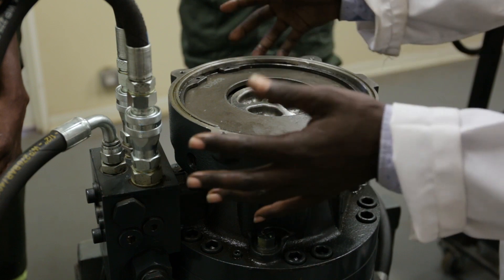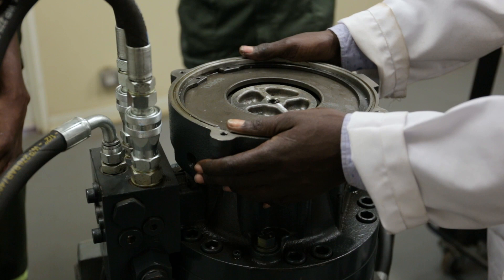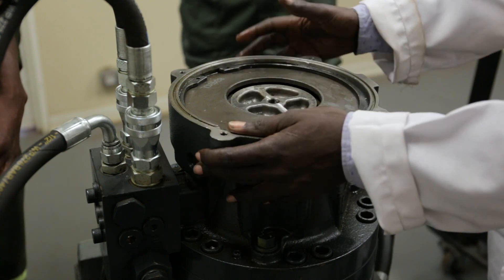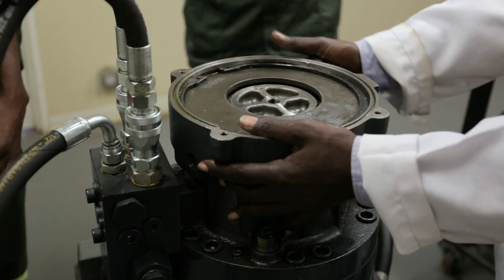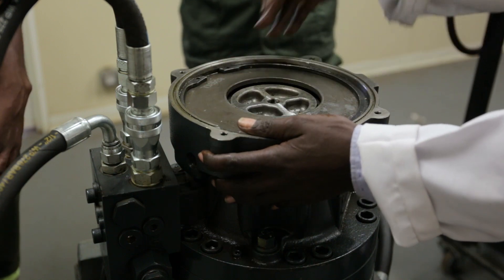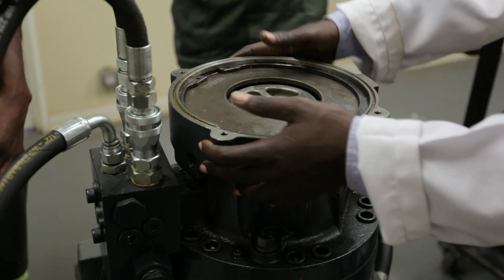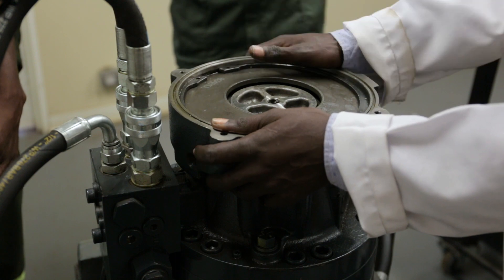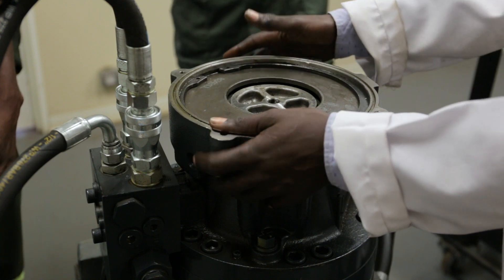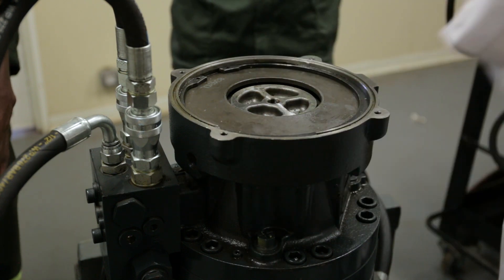The winch is rotated by hydraulic motors. Or hydrostatic wheels — those wheels which are on certain machines can be rotated by these motors. Instead of using mechanical means through the transmission, they can put a motor to just rotate. Even on the track-type tractor and on excavators, we can use hydraulic motors to turn the track chains.